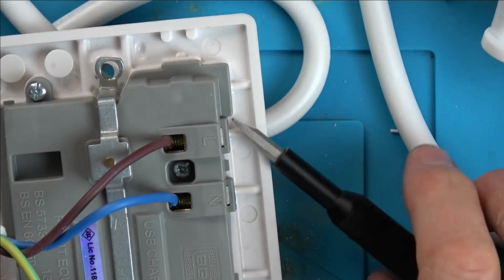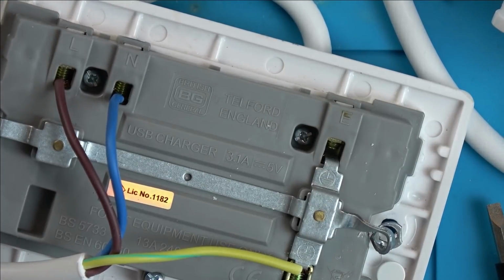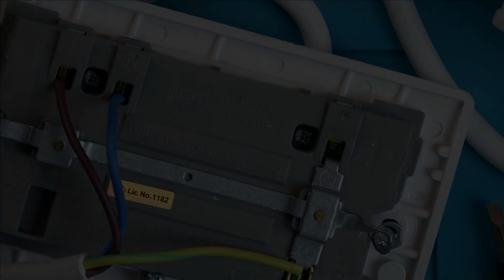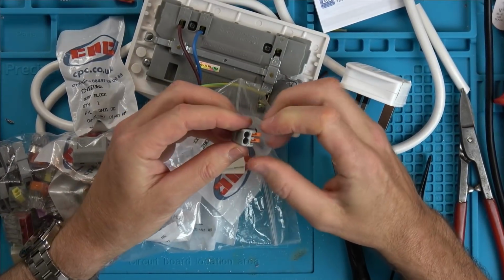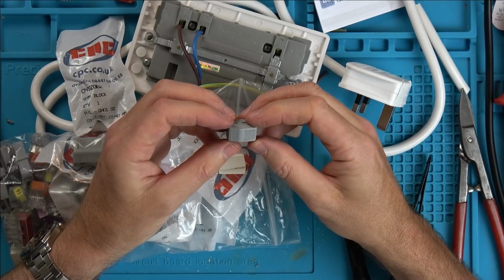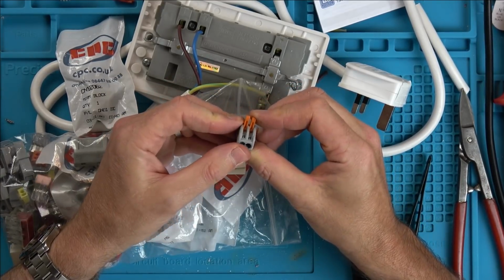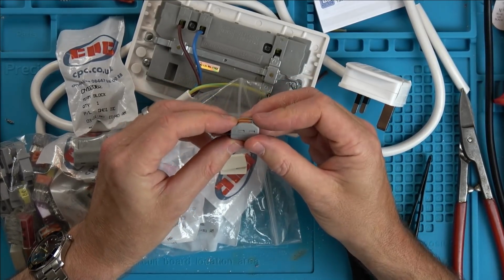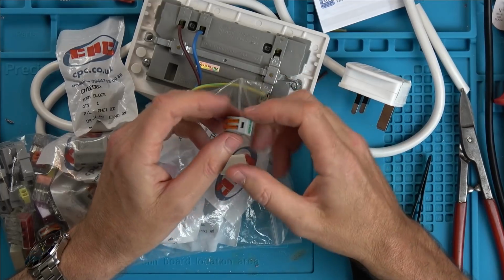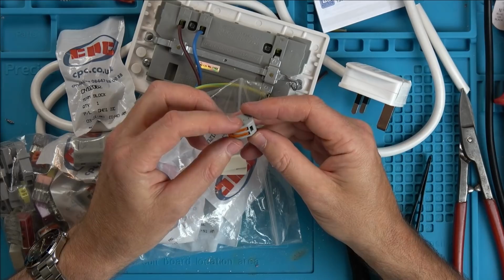Let me show you what a Wago looks like, because those of you who are new to my channel within the last few years probably haven't seen me mention them. Here they are. So you lift them up and then you put your cable into here, and this will do flex and solid core, this particular one, and then you clamp it down and it will join the 2 wires together, and it's maintenance free. So you can then put this in an enclosure and put it under floorboards and stuff. It's maintenance free, it's fine.